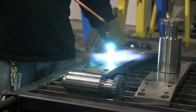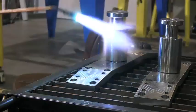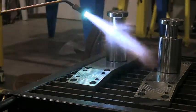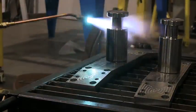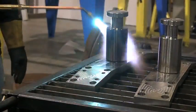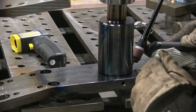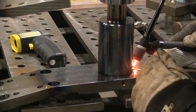This is part one of a two-part series. Here we're going to preheat, get some tack welds, weld one side, and then one pass on the other side. I'm speeding this up considerably — it took about two to three solid minutes of heating to get that pin up to temperature. On something shiny like this you can get an idea of what color the heat tint is at the temperature you need. I'm using an infrared gun to confirm I'm up above 500 degrees before I get that first tack on. I'm going to get one tack just to make sure it doesn't move, even though it should be swelled up and locked in.